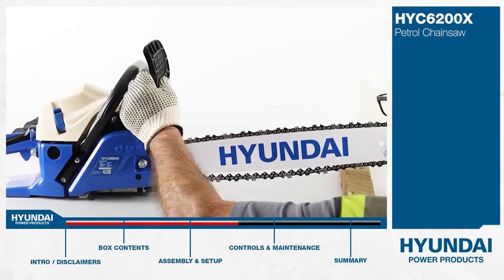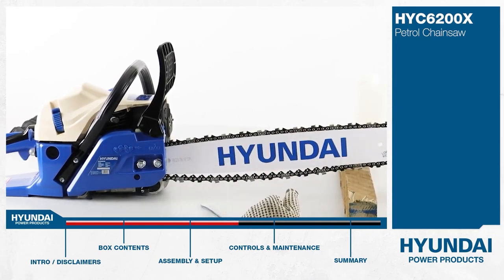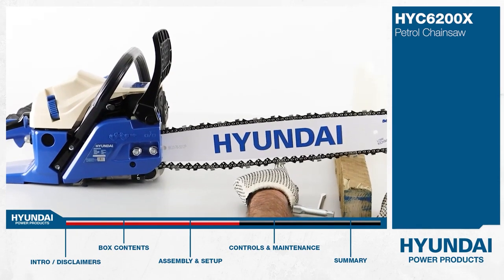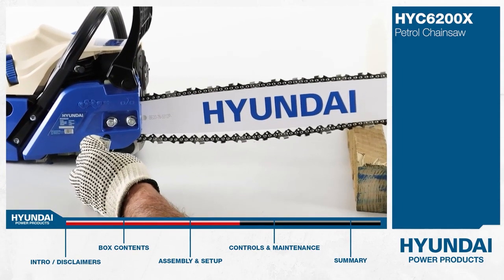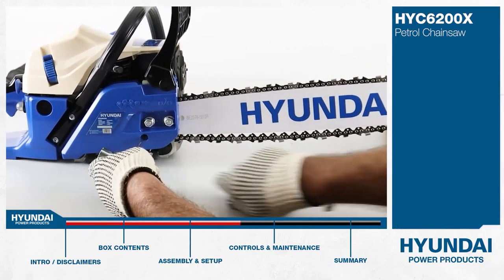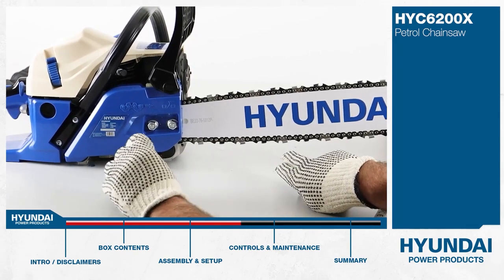Okay, so that is holding the bar in the upwards direction. Just going to make sure that all the chain is still in the groove, which it is. Now, this chain is incredibly slack at the moment. As you can see, it's not even in the groove at the bottom. So, we need to turn the adjustment screw. So I'll just go to the adjustment screw, remembering we haven't tightened these down very firmly yet. And as I turn, you should see, and you can, the chain going up into the groove.